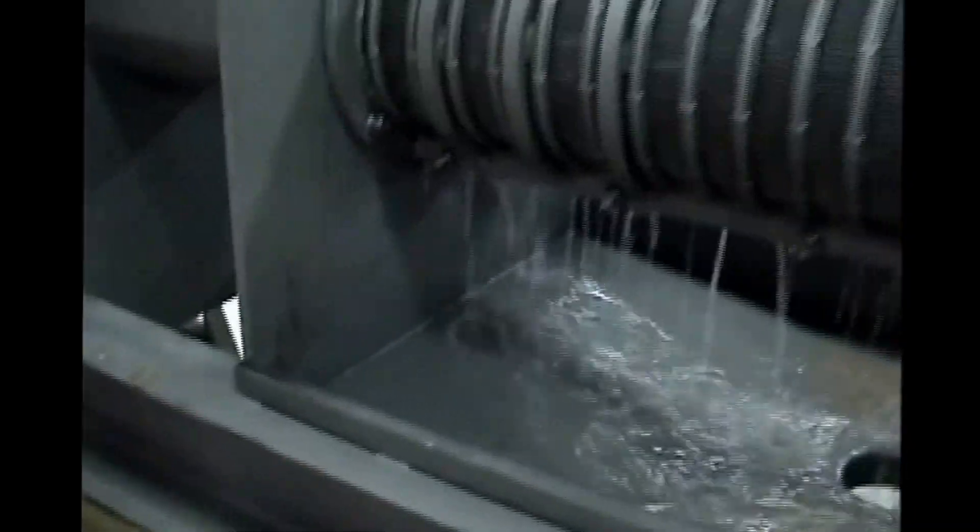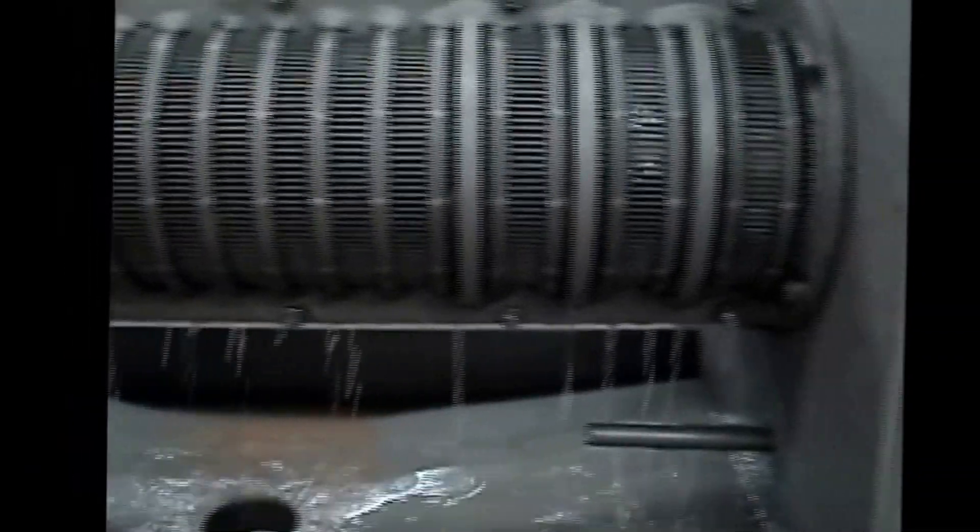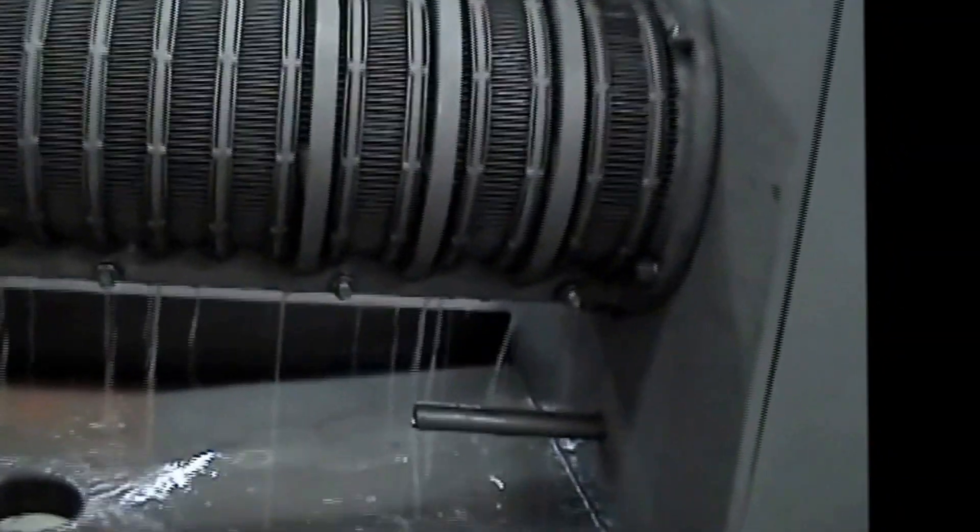It's got a lot of water in it so we're squeezing the heck out of it. The cone is not really opening yet — maybe down in there I can see it, you can't. We operated with the cone open to start with. Liquid is coming out pretty well from one end of the screen to the other at this stage. Looks like I'm getting some liquid through the drain — yes, I've got some in this pan down here, coming from the cone bushings. That's normal, that's why the pan is in there.